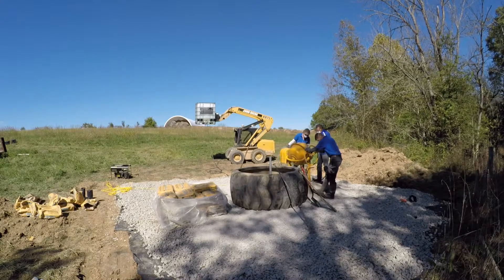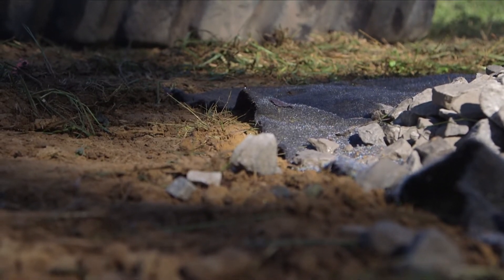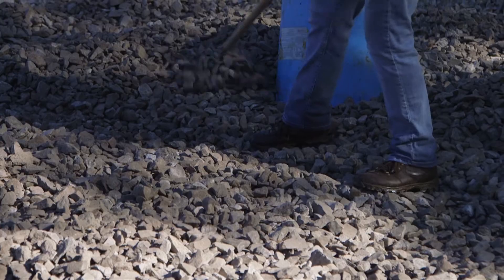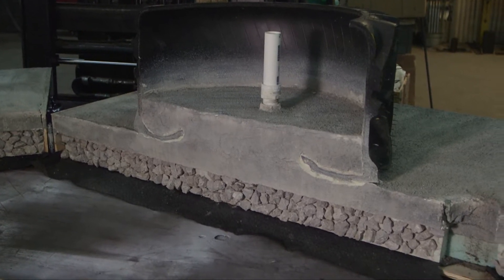Let's talk about some of the specifics of what you're seeing out in the field for our installation. We start at the bottom, the ground level. This is our non-woven geotextile fabric — it's a geosynthetic that helps to stabilize soil and separate your rock layer and your heavy traffic pad from the soil itself. We put this right on top of our compacted sub base of soil and pin it into the ground. On top of that, we add a minimum of six inches of compacted dense grade aggregate, which will serve as the base layer for the concrete that goes in and around our tire water.